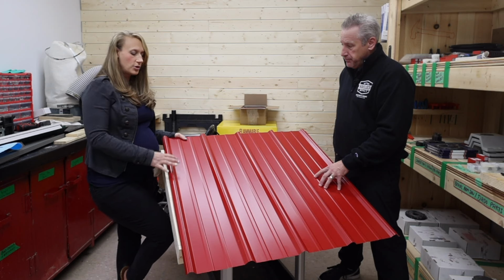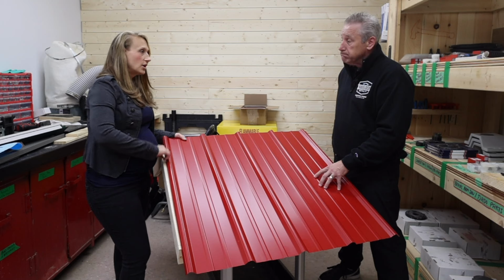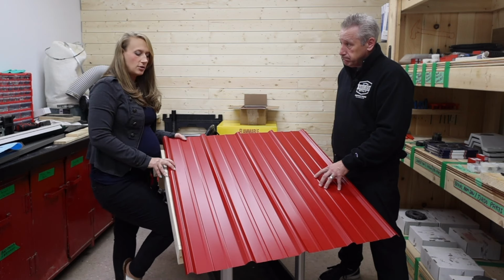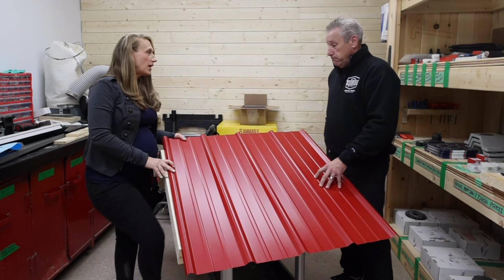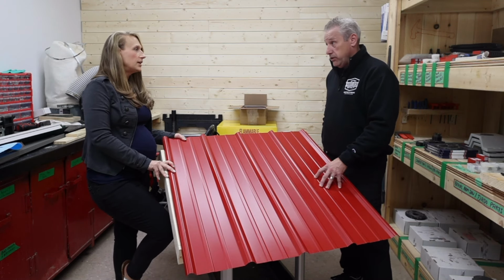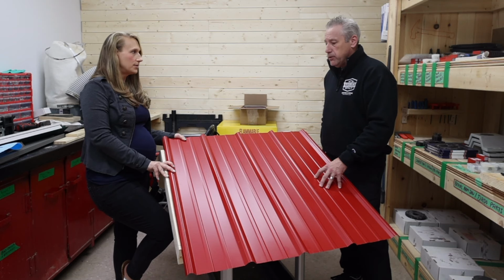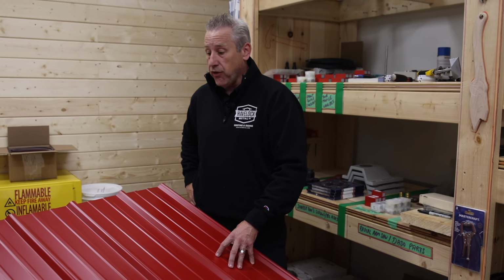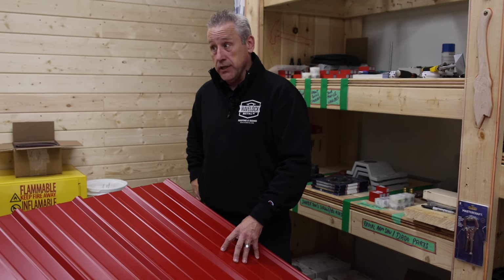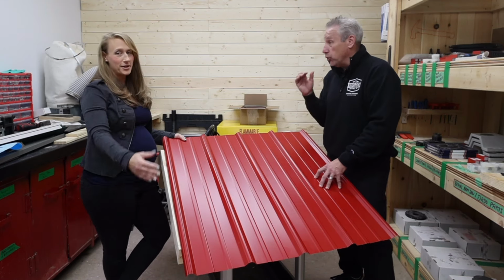Absolutely. Okay, so you guys are going to screw in, and we talked a little bit about why we do it in the ridge. For people in crazy high wind areas like Florida or something, should they be putting it in a different spot generally? So I would say your code may vary. Check that. Roofing is a pretty loose code as opposed to building materials. So there's not a whole lot where it's mandatory. But in those western provinces or western states or south where the winds are far different than they are here, going in the flat isn't a terrible idea. Yep. They also have no snow. Yeah, or less snow too. So therefore, not worry about backing up. It's more the water running.